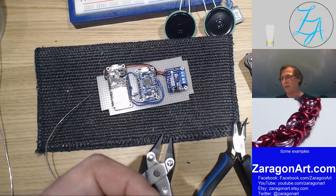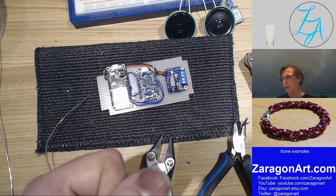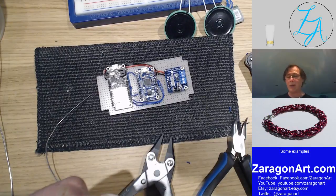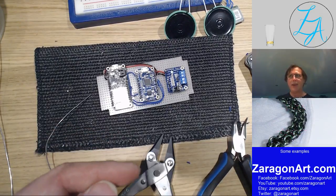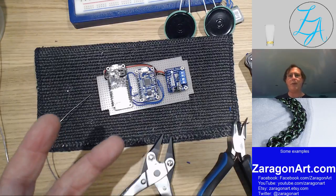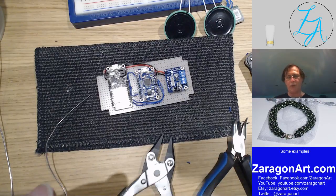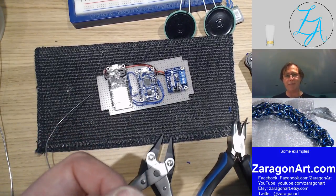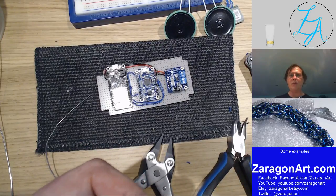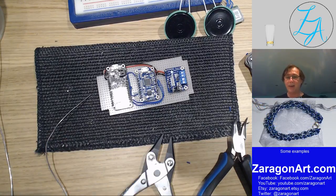But earlier this week, I put a USB 3 card into the PC, and this microphone has a USB connected analog to digital converter. When I plugged the USB card in, it changed all the configuration of all the USB throughout the whole PC. I know it took both cameras offline, and I had to reinitialize both cameras. It will have changed the setting that said that's a mono microphone, which should copy that mono sound to both stereo channels. That setting will have been reset, so it's thinking it's just the left channel. So I apologize. You are just hearing me on the left.